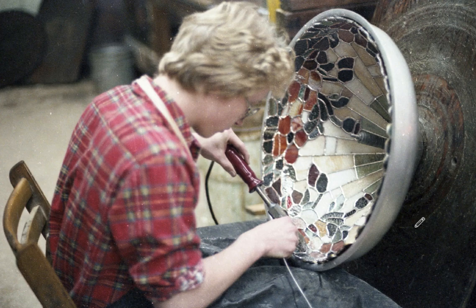They tacked it together or used beeswax to hold the glass in place. What we've come up with is a form that is a female part — made of wood, though this one is aluminum, spun. It's pretty heavy duty; it takes a lot of beating from working it, and one form will do thousands of lamps.